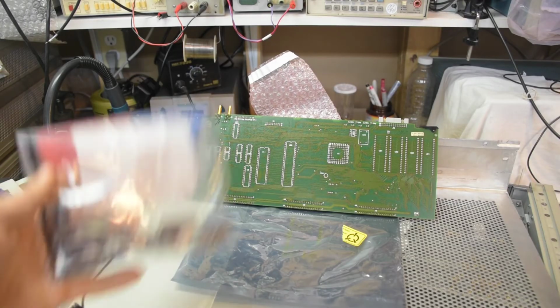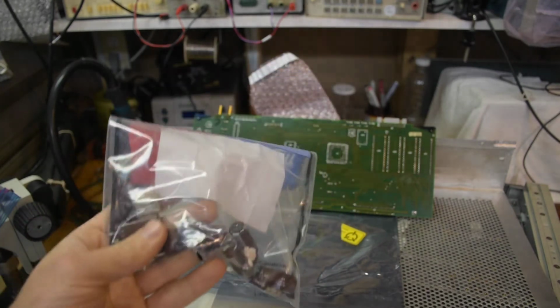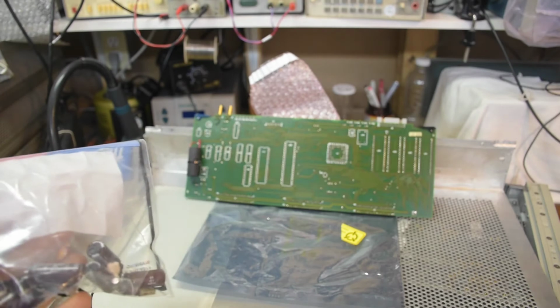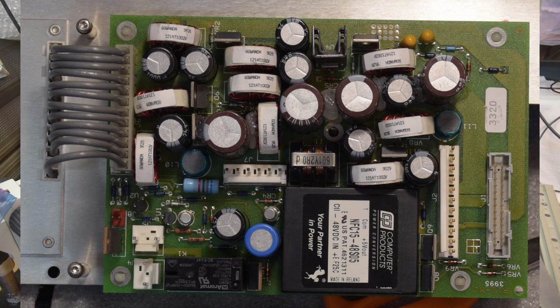Okay, so this is a few days later. I replaced a bunch of capacitors from the power supplies. There were 3 boards in there, 2 off-the-shelf power supplies. I didn't test all of these, but I just assumed most of them were either bad or going to be bad soon. A few Rifa caps and other LXF and TXF series caps. So I did those. The third board was an HP board, and it was just a filter board with a bunch of inductors, some what appeared to be overvoltage crowbar circuits, and regular capacitors, which all looked good.